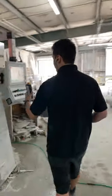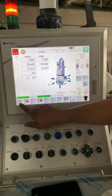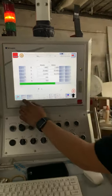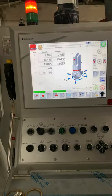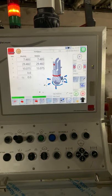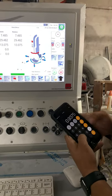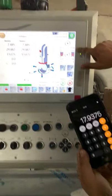Let's go over to our screen. We're going to click F1, and then F2. This is how you touch the blade off the table to measure the diameter. We're going to click F2 and it's going to give us some reading — 26.1. So we're going to take our actual diameter that we measured: 15/16 plus 17 inches, so that's our actual diameter, almost 18 inches. Now we're going to subtract this value.